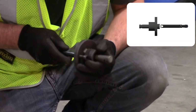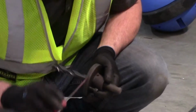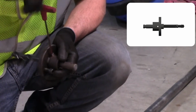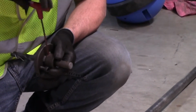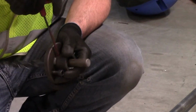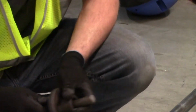Align the pilot drill flat with the Allen head set screw hole and insert the pilot drill through the center of the coring adapter. Confirm you've completely inserted the pilot drill and engaged the tapered flat. Look into the set screw hole for the marking on the pilot bit. Adjust the pilot drill until you can see the marking. Once aligned, insert and tighten the set screw. Test pull the pilot drill to ensure the set screw is properly locked in place against the pilot drill ledge.